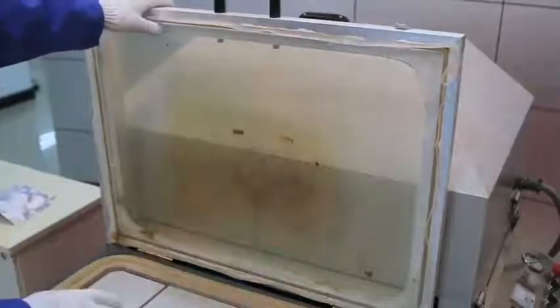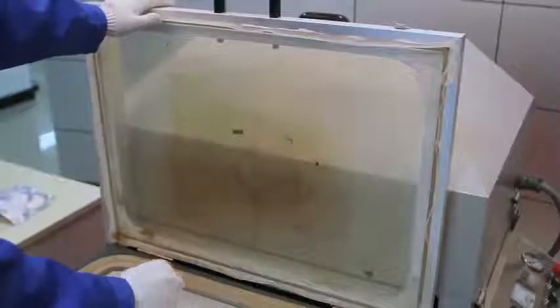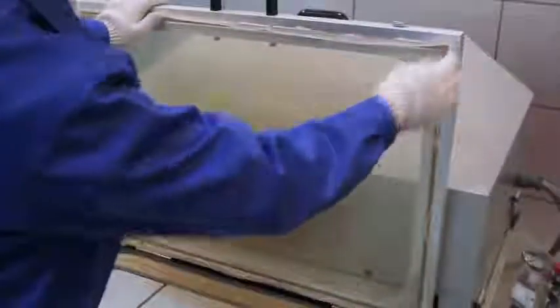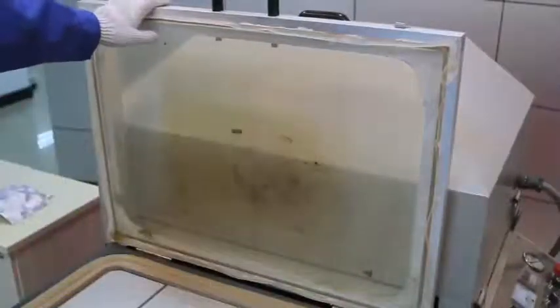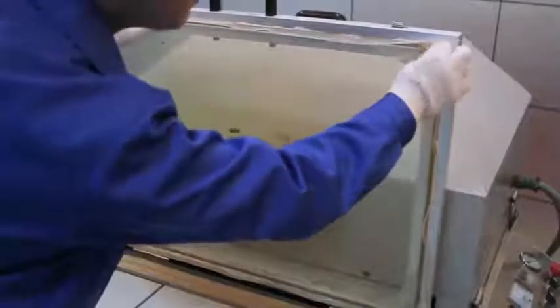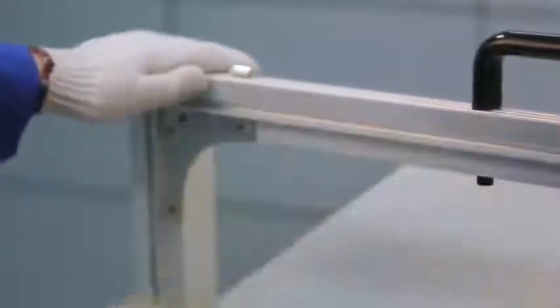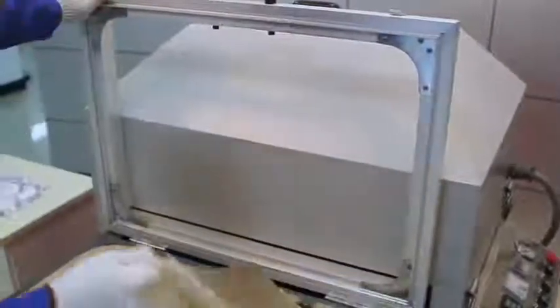After using the 3D vacuum press, the silicone cover sheet may wear down or become torn when imprinting sharper products. We need to replace the sheet, and this process is very simple. When the machine has cooled off, open the workbench cover. Take the seal out by pulling it from the corners and removing it completely. Keep the seal but throw away the silicone sheet.